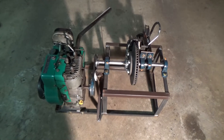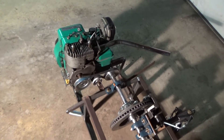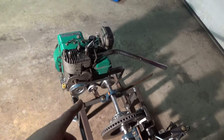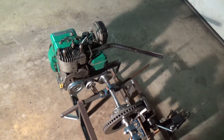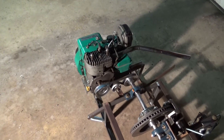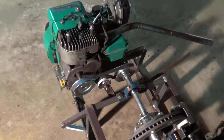That was actually last night. Today I've been working on it most of the afternoon, and I made a homemade clutch setup for it. I used to pull garden tractors, and I found out if you modify the clutch so that the pulling part of the pulley is straight from drive to driven pulley, and your clutch pulley presses up into the lower side of the belt being returned from the drive pulley, you get it to where the thing will not slip ever. We used to stall the engine on garden tractors before either spinning the tires or stalling the engine if you had enough traction — the belt would not slip. So I set this up the same exact way.